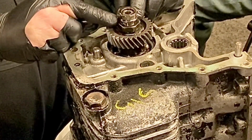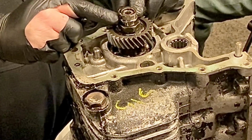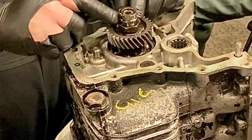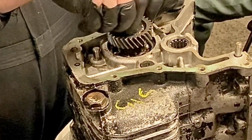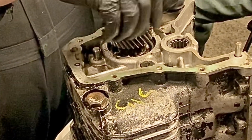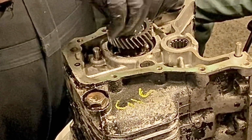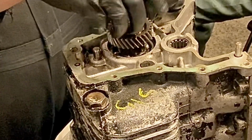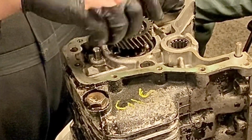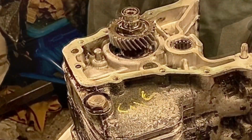Now at some point you run out of thread, and you're still pushing the bearing, right? And there's enough force on there to basically lean over the last thread. So when there's enough force, it damages it. So what you did was right. You just spin it off, but you don't spin it all the way off. Now what you need to do: 2 tire levers, pull that bearing race off.